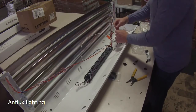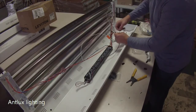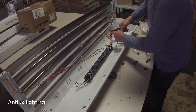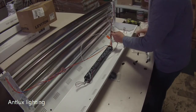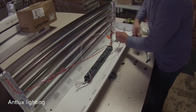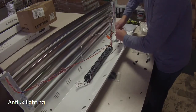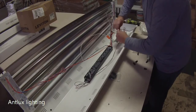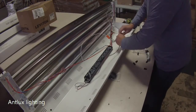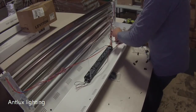You're going to take it and wire it to the red lead coming off the sensor. Sometimes there's a little extra wire, so it's better to clean up your ends. So you got the red going to the power coming off the ballast. You do that with a wire nut. Seat it down as much as possible. Tuck it into the fixture. Fish your wires through.